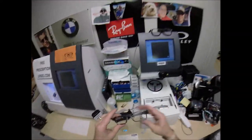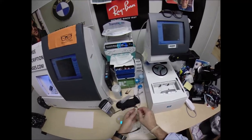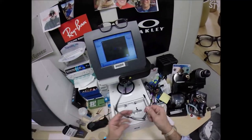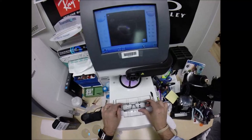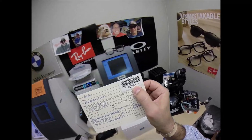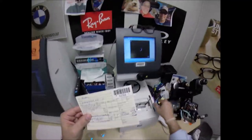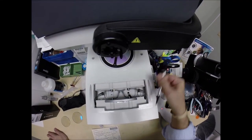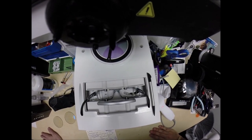I'm going to pop out your original demo lenses, one of which says Oakley. You're going to get all of this — all the manufacturer's original packaging. I'll take the little plastic from the bags there and place your frame into the tracing element of my blocker. Program the shape — your secret agent 2384. So years from now, should you ever need new lenses for this frame, I can mail them right to your home. I'm going to hit the start button. A little stylus is going to pop up, go around, trace the inside bevel of the right side of the frame first before doing the same thing on the left.